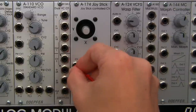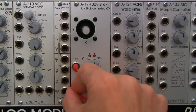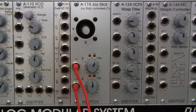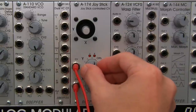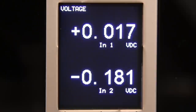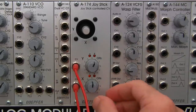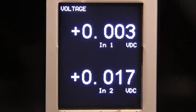I'm going to patch my Y output voltage over to my Dave Jones Design O-tool so we can take a look at that. In the center I'm not quite hitting zero, so this is where I can go in and adjust my offset. The top number on the O-tool is my Y axis, so I'm adjusting it ever so slightly to get it as close to zero as possible. Now let me adjust my X just a little bit and see if I can get it as close to zero as I can.